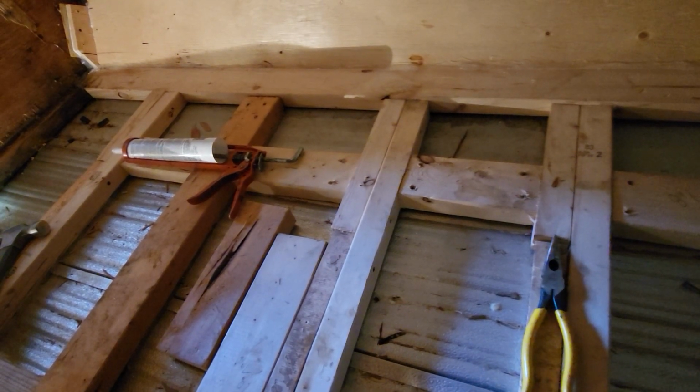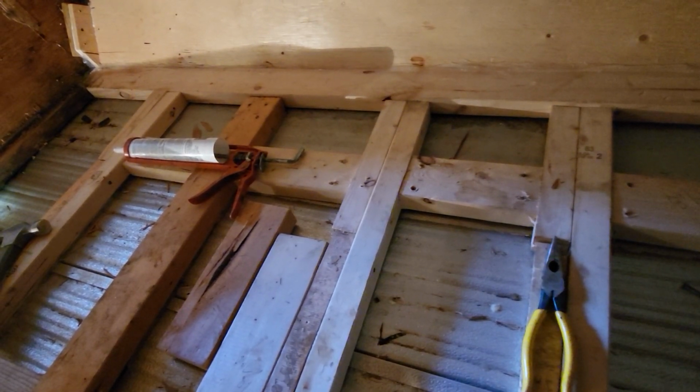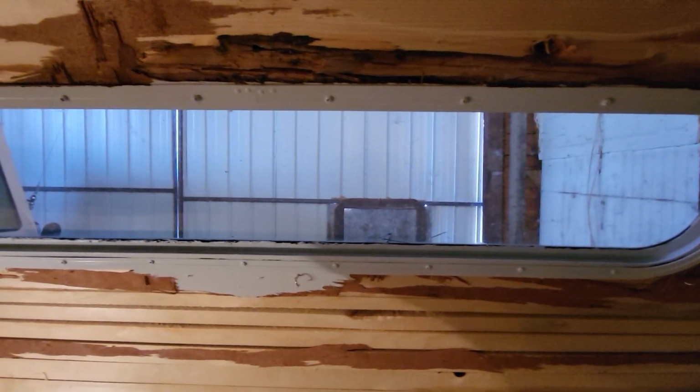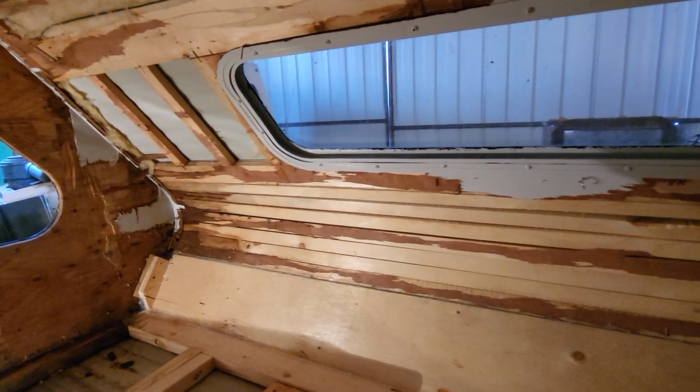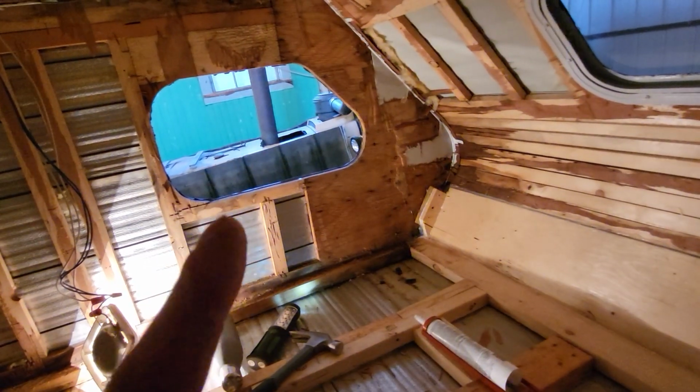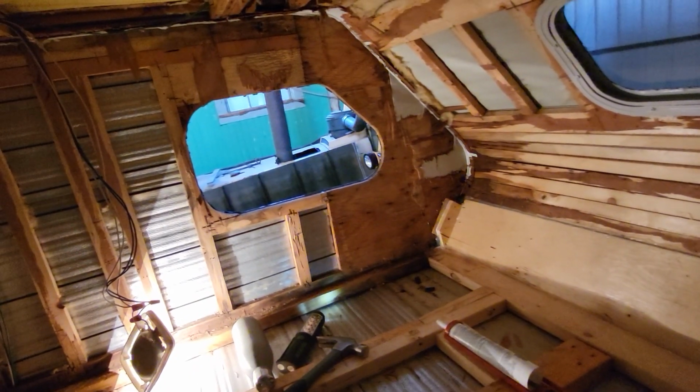I did a water test with my dad last night, and what we found was this window does not leak, that we saw. I poured about 3 gallons of water over the roof. That window is leaking from the bottom, just in that one spot right at the bottom, but I had also taken 2 screws out of it, to take it out fully. This one was leaking from the same spot at the bottom, right on the right hand side of that stud, and I hadn't taken any screws out of it. So I'm going to re-butyl tape everything on the outside and put silicone all around everything. So that is the plan there.